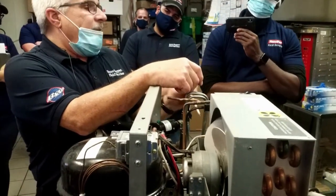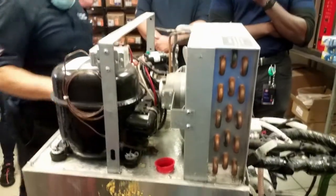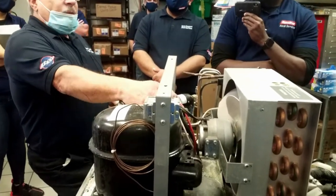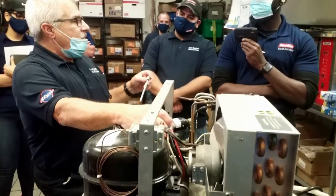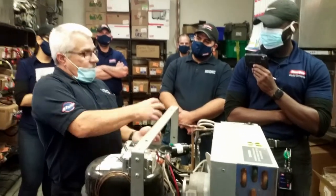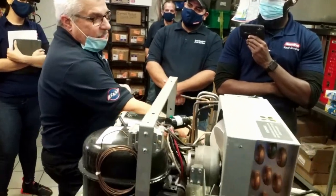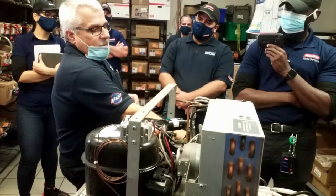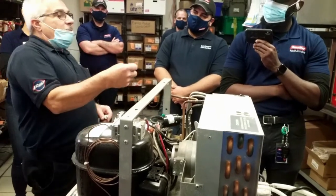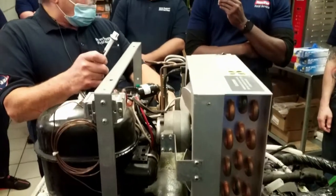The other thing that can happen is that ice bank is right aside of this tank. And if you get water dripping in it and you can't tell, that refrigeration system is going to run a little abnormally. And it may freeze heavier at the bottom than it will at the top of that ice bank. And it starts to freeze into the tank. It'll actually freeze the water in the bottom of that tank. So when you get nothing but syrup out and everything looks fine, it's probably frozen in the bottom of that.